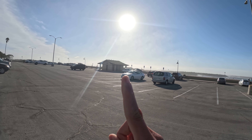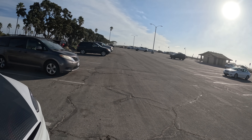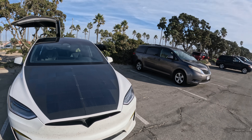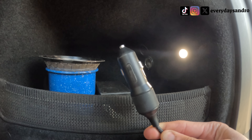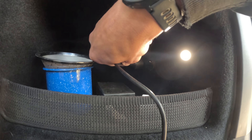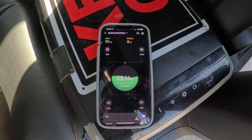Today is a real-world test. We're in Ventura — those are the solar modules. Normally, if I charge it using the DC outlet in the back, I get about 110 watts, which is pretty optimal and charges the EcoFlow in about 10 hours. Right now I'm getting 114 watts — a little bit more than what I'd get with the DC. I actually just peaked at 135 watts driving over here and I got so excited. My life just peaked.